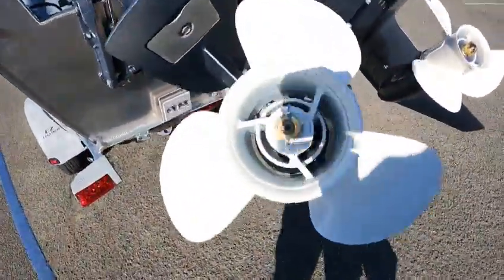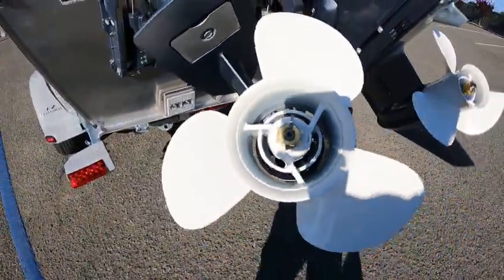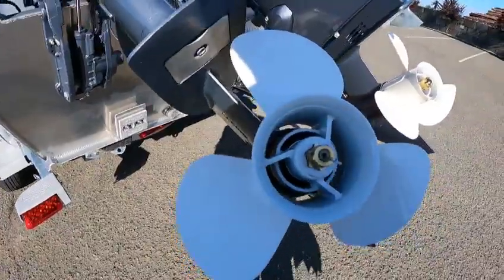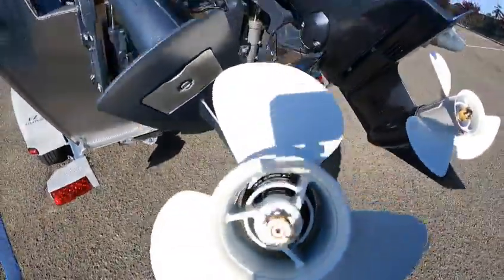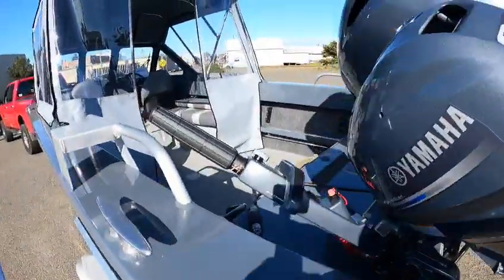This 99 is a high thrust — if you look at the opening here and the big prop right there, that gives you more backup, about 70 percent more, because the back pressure releases out the back. You got a 25 gear case and then you got power trim right here.